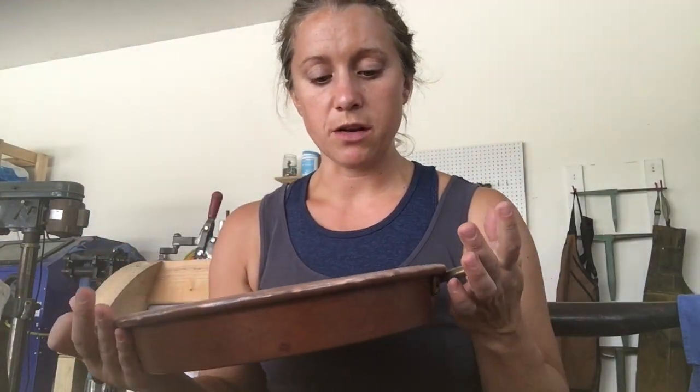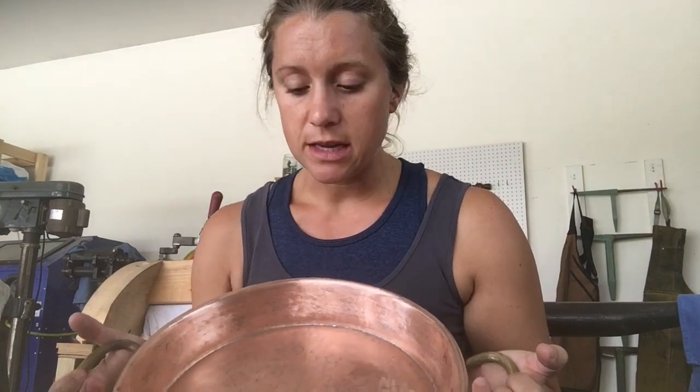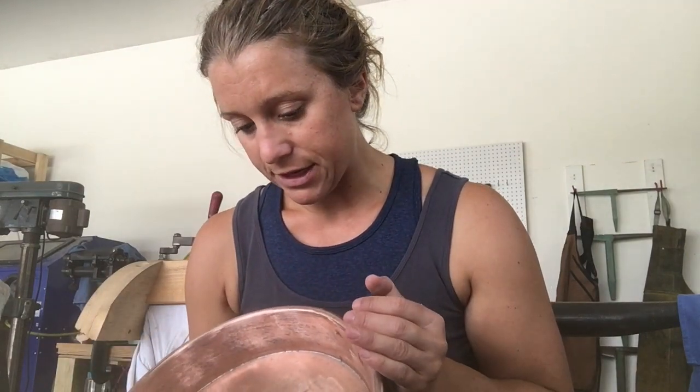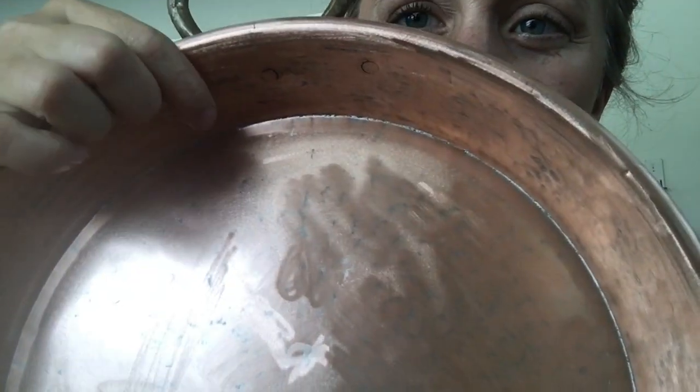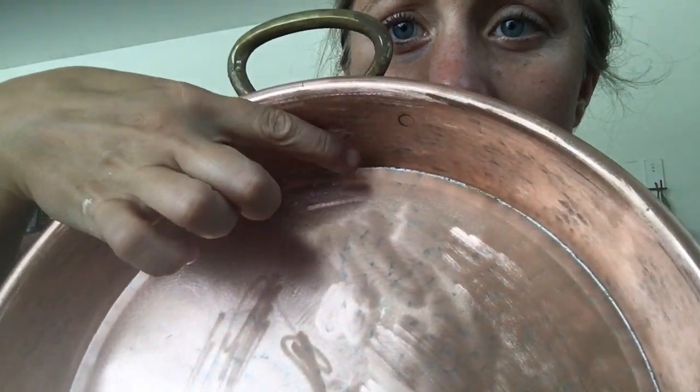This one has been a lot more cleaned because it came to me with very little tin still in it, but the tin that was in it was in really rough oxidized shape. This is another one where it's maybe easier to see — there's a little bit of darkness in all the seam work that needs to get brought out before I tin, or I'm going to have problems. It's not going to adhere, and I'm going to end up burning or scorching the copper underneath, making it harder to clean later. Or the flux will start to burn, and once you start burning your flux while tinning, you've created yet another issue.